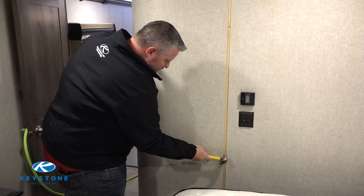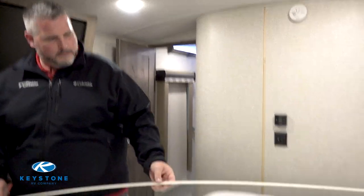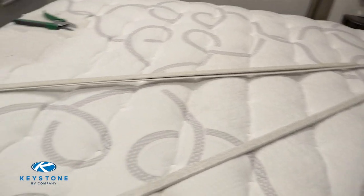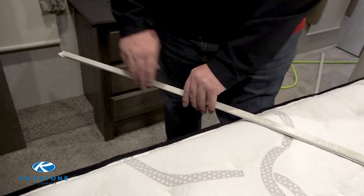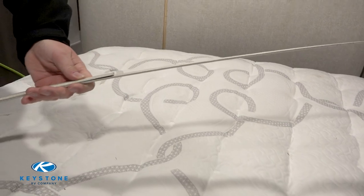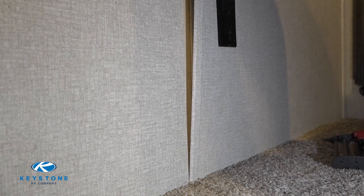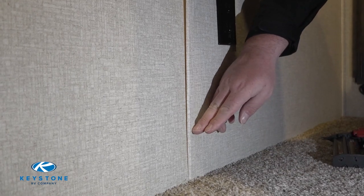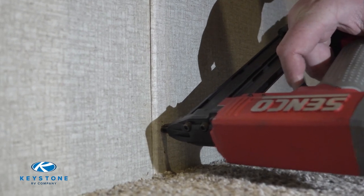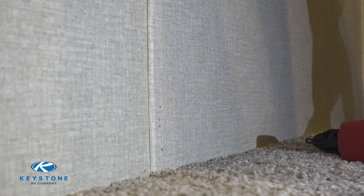Let's install the new piece of trim. While there is no set way you have to go by when attaching trim, it is best to start at whichever end will be the easiest. With the old piece of trim, lay it on top of the new piece and push both ends together. At the end that you're wanting to remove, you will leave one extra inch available to trim off. When installing, set the trimmed-off end flush to the floor and allow your trim to run vertical with the seam you are trying to cover.